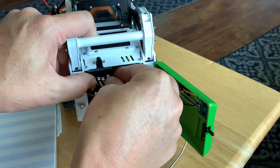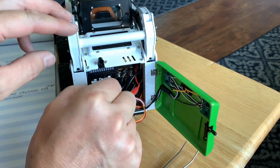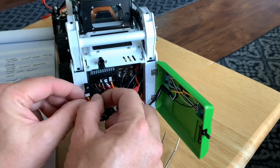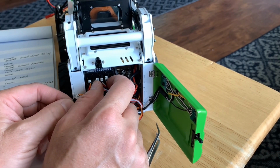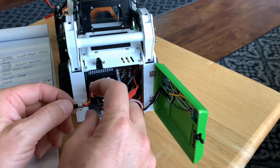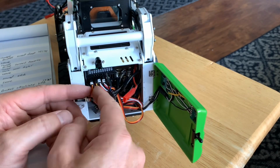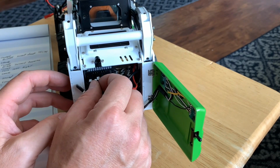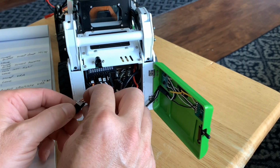Now, the other thing I want to touch on is this i6s radio is fantastic. I won't be able to do everything I want to do with this i6s because the one limiting factor it really has is that it's a 10-channel radio, which is fantastic, however, it only has 4 mixes, which kind of limits you on what you can do, especially for mixing channels. And when you really get into these computer radios, mixing is a huge thing to really make these things shine as radios. But this radio is sub $100.